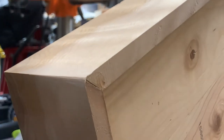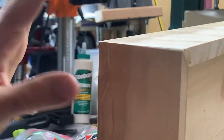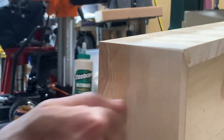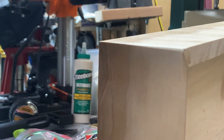You can see it disappears. When it dries you might have to hit it again because sometimes it dries darker, or you might still have to bend in the wood fibers with the edge of a screwdriver or a burnishing tool — just run it back and forth with light to medium pressure. So yeah, pretty quick fix for miters.